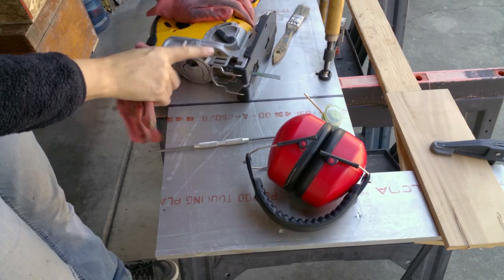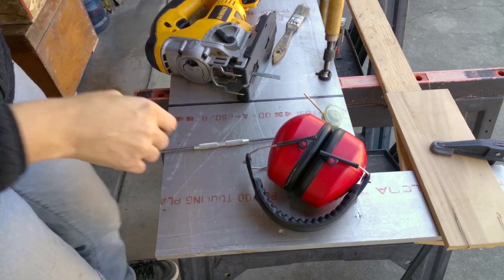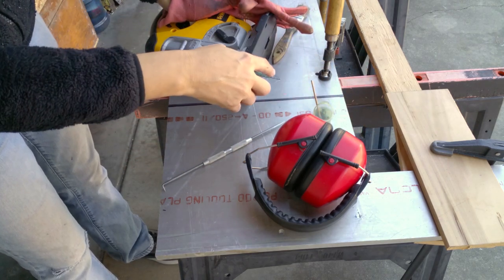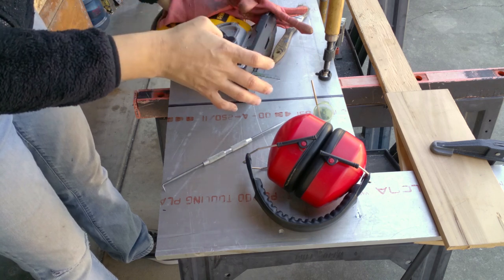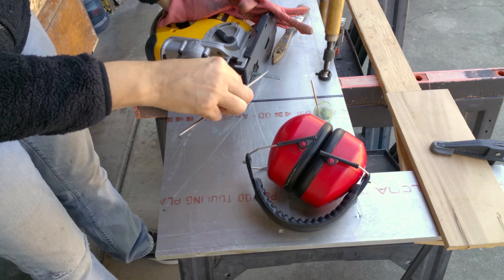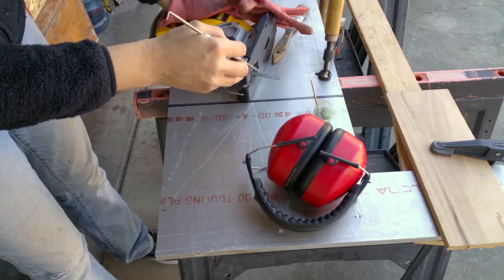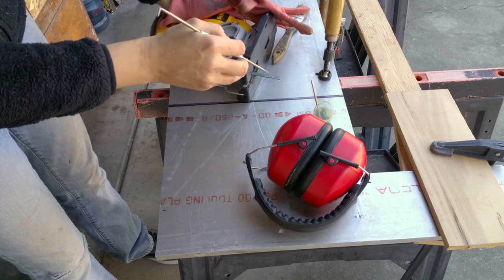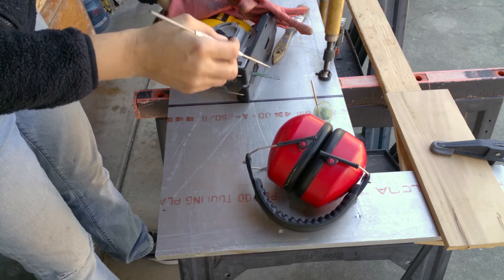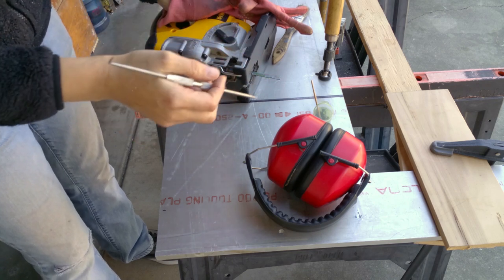I'm making cuts with this battery-operated saber saw. I'm getting better results by using grease on the blade rather than oil, because it stays and it seems to keep the chips from bonding to the blade. I wish these blades had teeth made in such a way that they would eject the chips. It's not such a problem with steel, but aluminum kind of galls and makes its way in there.